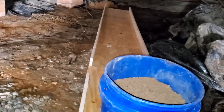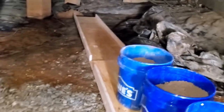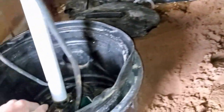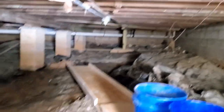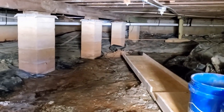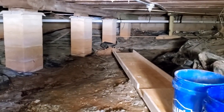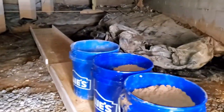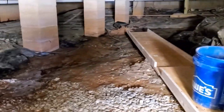Remember what we're doing — we're actually raising the grade of this crawl space. Over the years, all the sump pumps they've put in here have sucked out the soil. You can see how much higher it is in the back than it is here. This pump, you can see it down there, actually sits below sea level, and at high tide that groundwater rises up and burns out their pump. We need to raise this up about eight inches, just through this section right in here. This is where the water has been sucked down. We raise it about eight inches so that it matches the other side, and then we can raise the pump up a little bit.